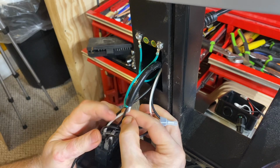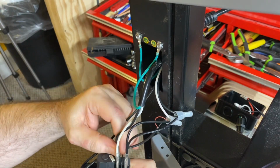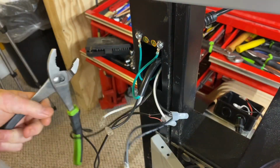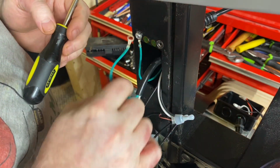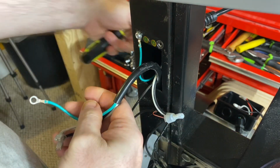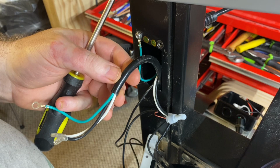So I've got my 2 legs, the AC power, and a ground. Okay, I should be able to feed this down through and out the lower end headed toward the motor, and leave this wire connected to the old motor for use somewhere else.